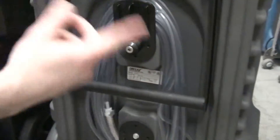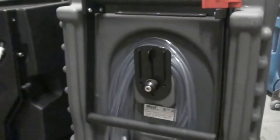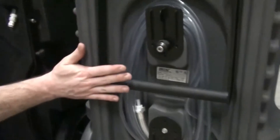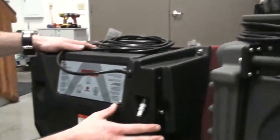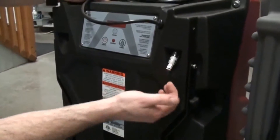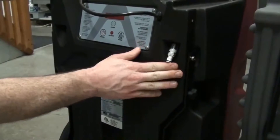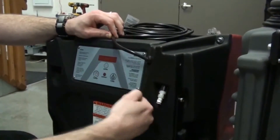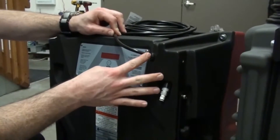Down here on the bottom of the Evolution, there's also an additional hose management area with a quick-release function for rapid hose removal. The skid rail assembly is built out to ensure no contact with components on the back. On the R150, the skid rail is minimal, so the hose protrudes beyond the back surface and can catch during loading and unloading from the van. The power cord also sticks out, putting stress on the strain relief during contact and potentially causing the conductors inside the wire to fail.